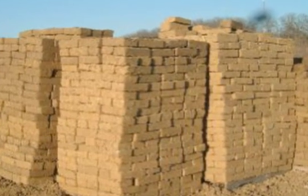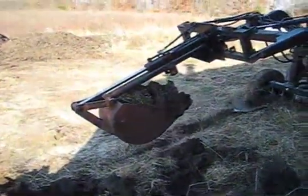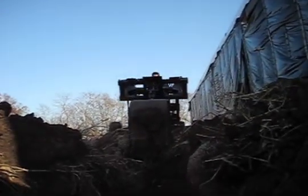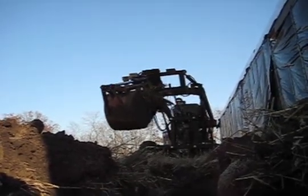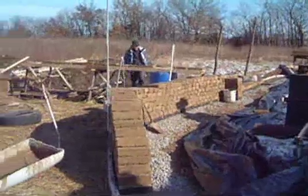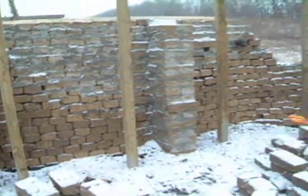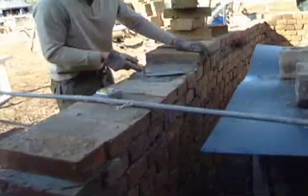We pumped out almost 6,000 bricks in total and started to build our addition. We started by digging a shallow insulated foundation insulated with 2-inch R10 pink foam. We used the backhoe, which was very effective — it moved from side to side by articulation of the tractor. We then put in the battery bank and stove into place before the walls were built. We leveled the foundation, tarred the bottom course of bricks, and started laying. Walls went up rather quickly, except when frost made it hard to get the bricks off our piles as they stuck to each other. Our soil mortar froze too, and a section of wall fell down when the mortar defrosted and shifted. We reinforced the walls with posts and started to use regular cement mortar mix.